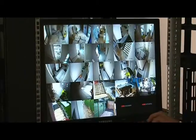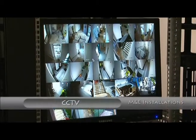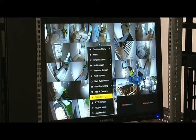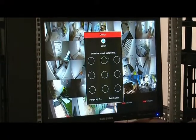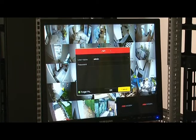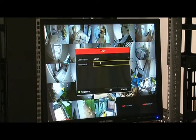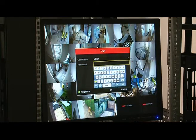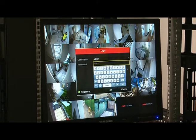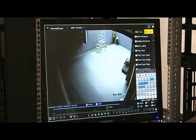Use your mouse. Right click once — it brings up the menu. You go down to playback, left click, and you get a pattern. For authorised persons, right click on that and you can enter your password. At the minute it's just set to Q-tech, which is a capital Q, T-E-C-H. Enter that and that will bring you to your next menu.